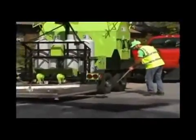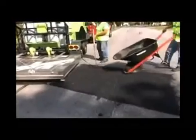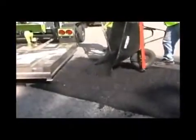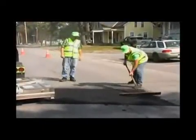With the second area ready, the picture framing and scarifying process begins again. New hot material is brought in from the reclaiming bin as needed, and the surface is prepared for compaction. When properly compacted, a thermal bond will be created between the restored area and the surrounding pavement.